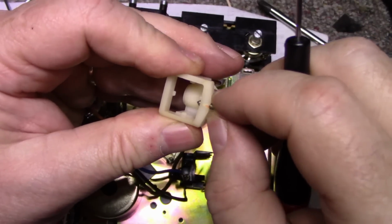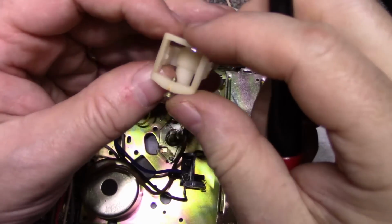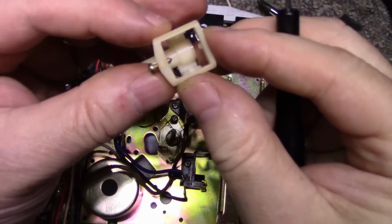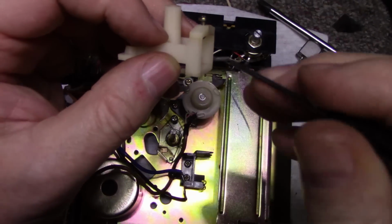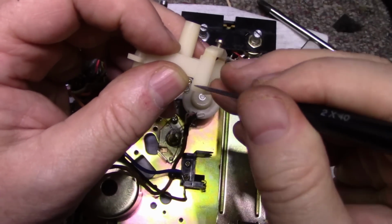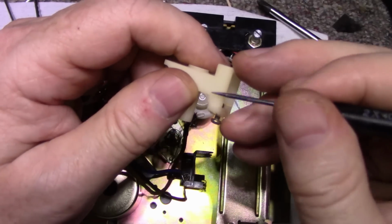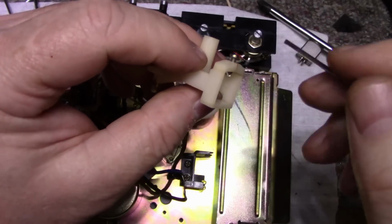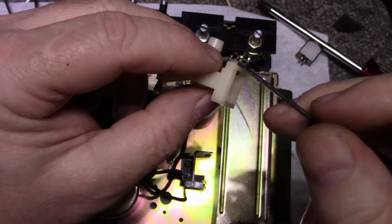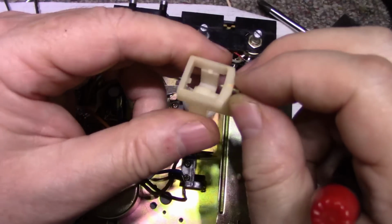That's the only way that this is going to hold, is if it's wrapped. Something's wrapped around the outside of it to clamp it. Yeah, I think I might just wrap it. I'll get some string, clean this outside very well. Actually, I'll sand it down too to get rid of the coatings. And I'll wrap it, and then I'll put epoxy over the wraps, and that'll hold everything tight.